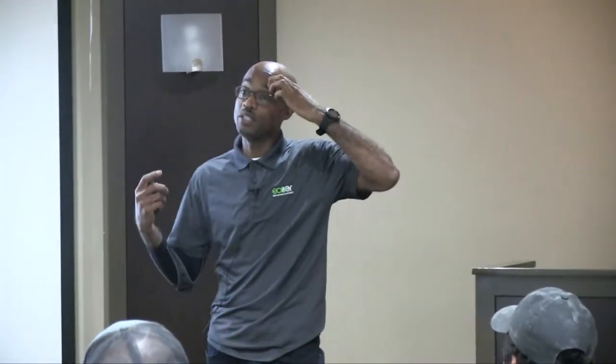for no reason. We also had a case where a contractor called us, and I think Kelly, you had mentioned something to that effect, where the homeowner called him and said the unit hadn't worked for like a week, right? He thought he needed a new PCB on the unit. He was actually at the job site calling us. We pulled up the system, it had an IoT gateway. We could see that the unit had run probably 4 or 5 hours before he got to the job site. So we knew it was working fine. He didn't have to change the PCB. There was absolutely nothing wrong with the unit. He needed a thermostat. And that saved the homeowner and him time and money.